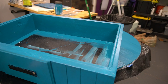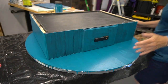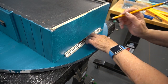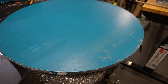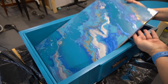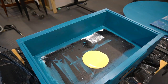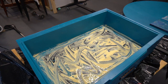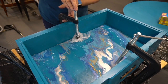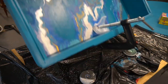With everything dry, it was time to fit the drawer to the tabletop and mark the placement. Once I was happy with the placement, I marked the holes for the two piano hinges. I used a nail set to make an impression in the top, as it was going to get more paint which would have covered pencil marks. Once the paint pouring was dry, I tested the fit in the drawer, then poured and spread wood glue in the bottom and put the paint-poured panel in place. Seat clamps were perfect for keeping the panel in place while I brad nailed from the back.